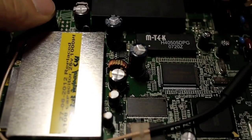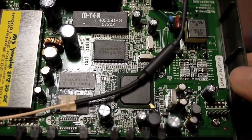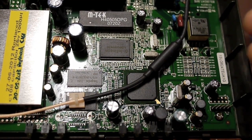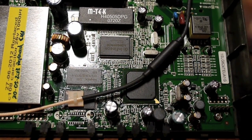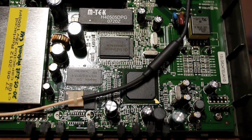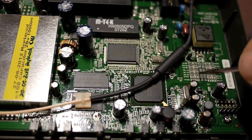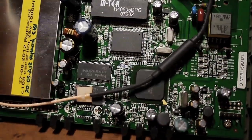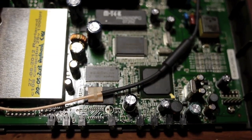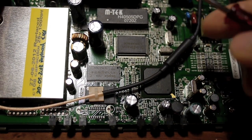These two look fine and all the other ones look functional. However, as in the case of capacitors, a damaged capacitor exhibits obvious signs such as bulging or leaking. Sometimes they fail gradually over time with no visible sign yet. With this kind of problem, it is likely caused by these smaller capacitors — the 25V 47 microfarad, or these 25V 100 microfarad capacitors — which are responsible for filtering the ethernet port connections.